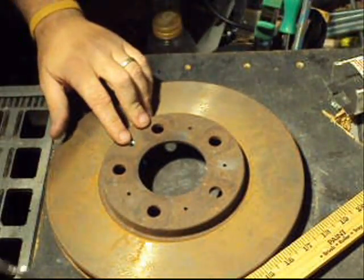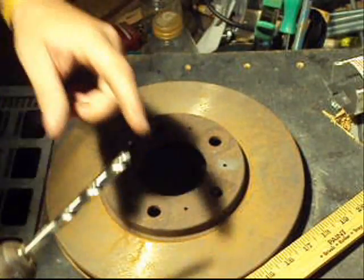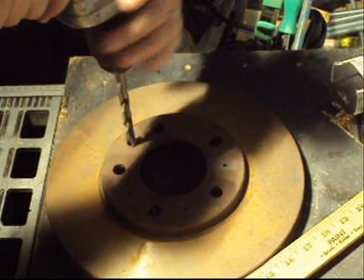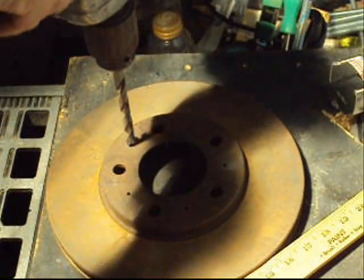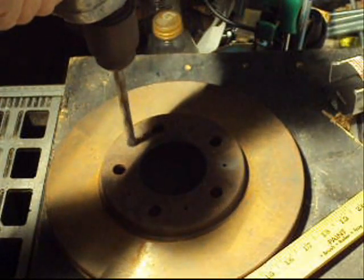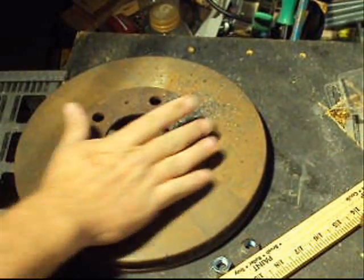Drilling these holes out with a smaller drill bit — I used a 5/32nds drill bit. The end of your drill is not very pointed for a bigger drill, so always tap out a pilot hole. It also helps you get more accurate. This has to be drilled straight up and down, just like a drill press did it. Mine's out right now, so I'm just going to have to make sure this goes in perfectly square.